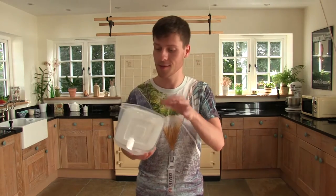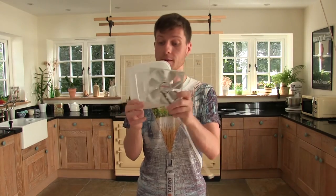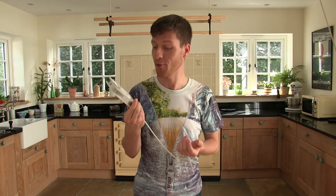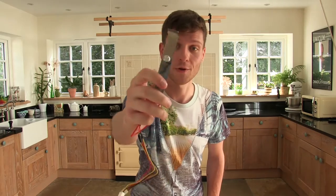What we need first is your box. The only thing to note is the lid has to be the same width as your fan, so that when you put it together it all fits. On the subject of the fan, make sure you get one as wide as possible, because the wider the fan, the slower speed you require to get the same airflow as a smaller fan — which means it's going to be quieter. This one is just a 12cm fan I got from a computer, and I already know it's a nice and quiet fan. I also got this fan speed controller. It's not really essential because the fan is already quiet, but it means you can get things even quieter if needed, and it's something I already had laying around.